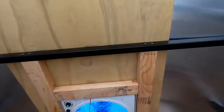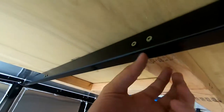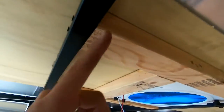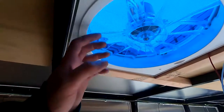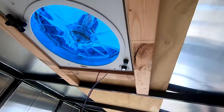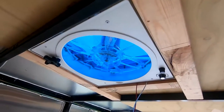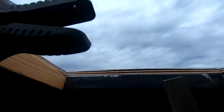Framing is all in place. You can see where I drilled the holes and put the screws through. I drilled holes instead of putting self-tappers because all I want to do is sandwich it using the head of the screw and the threads so that it holds it in place — nice and flush, nice and clean. Once you have your hole drilled, you'll want to use a file to get rid of the burrs you've created, since the edges are pretty sharp.